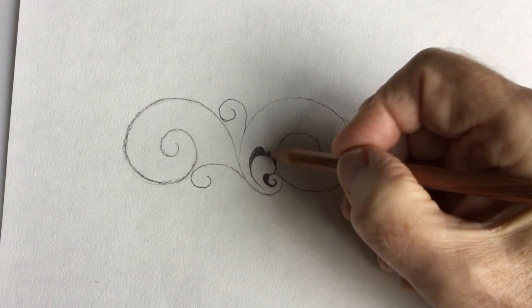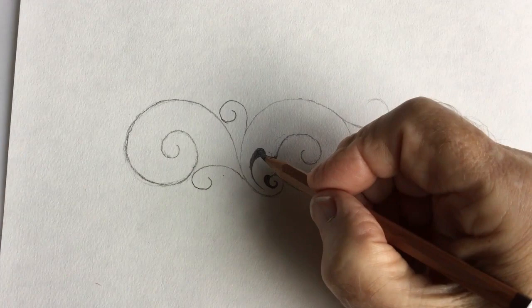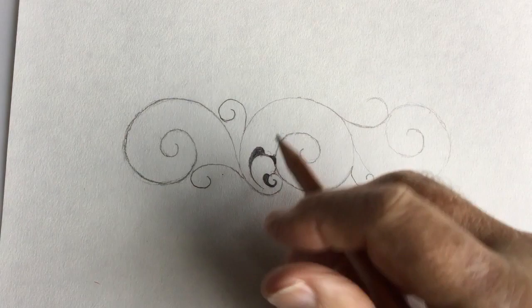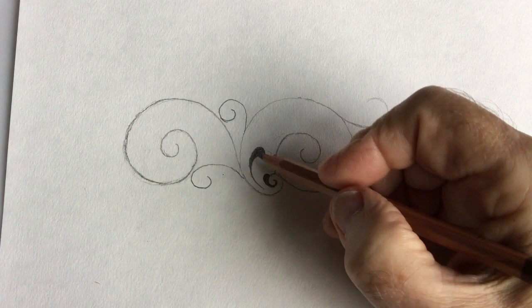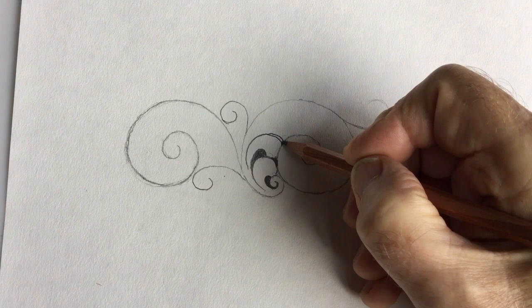This here would have been one cut, a deep cut, with a type of chisel - so it wasn't excessively sharp. Because if you make your gravers too sharp, they don't flick out, so you have a wider, slightly wider set on it. We start here and follow it right the way through. You don't come back, just do it in a natural way - slightly larger here and darker here.